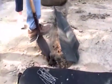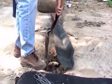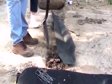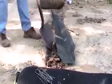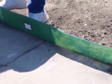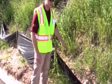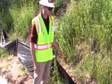Another alternative to silt fence is a product like the Urtec Edge Guard. They also have the perimeter guard. You actually dig this in behind a concrete sidewalk or curbing and bury it, so it doesn't use any stakes, which is kind of nice. The rigid plastic will stand up on its own and if somebody were to drive over it, it will spring back into place. When the silt fence reaches one third of its height filled with sediment, that's a good time to clean it out and get all that sediment removed.